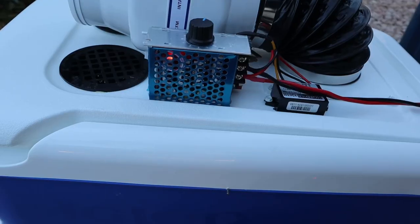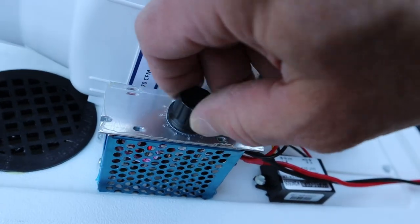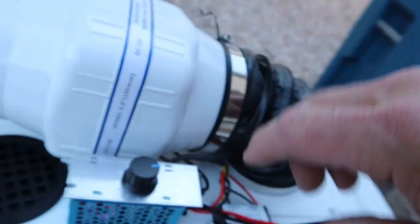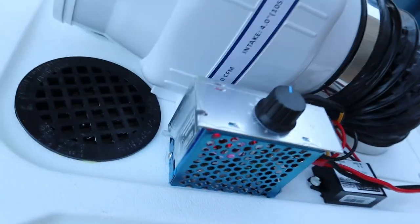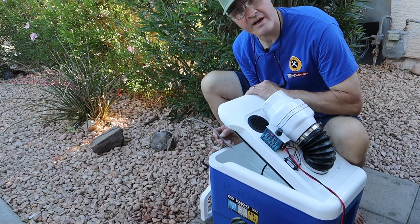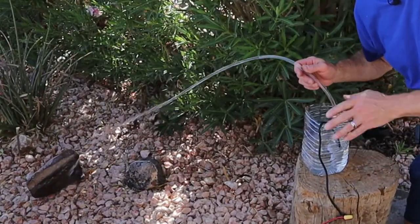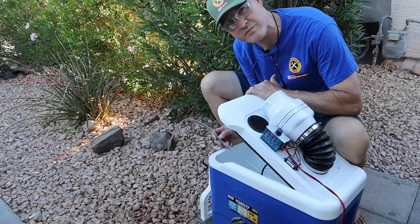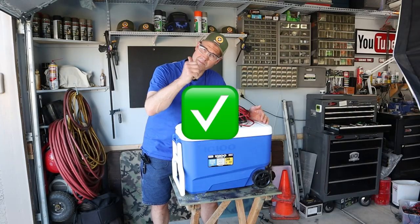Let's check out the pump. We've got the power on — it's no longer connected to the fan. The fan is independent of the pump now. Fan's off and the pump is pumping away. You can see the water flow is at a much lower rate — knocking it down from 12 volts to 5 volts is a definite improvement. Mod number two, rewiring the water pump, done.